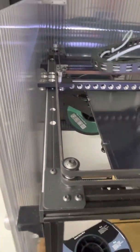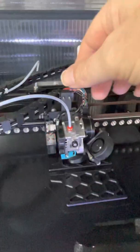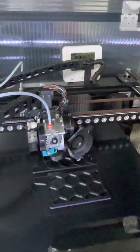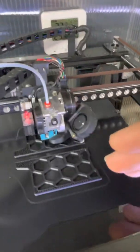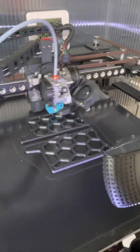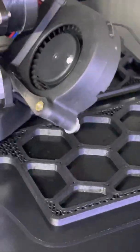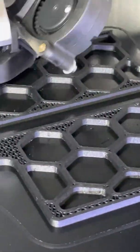There's not absolutely no movement in the frame, but there is much less than there would be without input shaping. Input shaping is a great way of compensating for any flex in the frame and any mass in the moving parts causing vibration. Now you won't always get 100 millimetres a second printing — it depends on the size of the print features, and your settings in your slicer such as Cura will make a lot of difference here. Tweaking those settings will allow you to get the prints as smooth as possible and you'll get really nice finish and really consistent results.